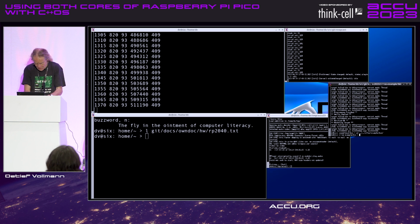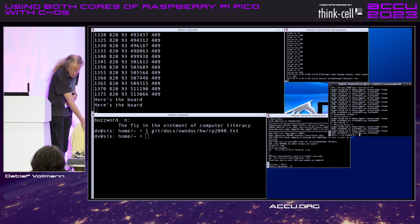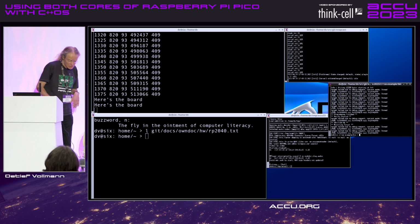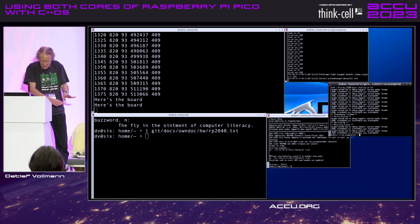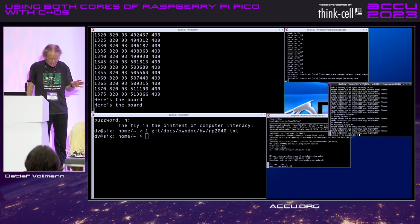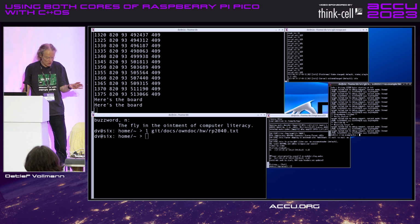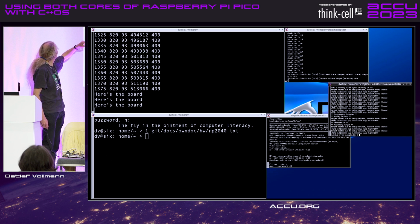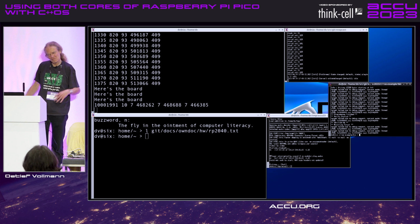I've already built it, so just download it. So now you saw this blinking because it was downloading it. And here you already see, well, it started somehow, but it doesn't blink. For some reason, the Pico RP2040 looks like it's pretty hard to reset. So resetting via JTAG often doesn't work, so I just power cycle. And now the LED blinks. And here after 5 seconds or something like that, after 10 seconds, it starts to print something. So, fine.